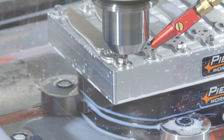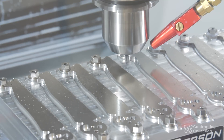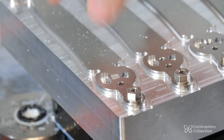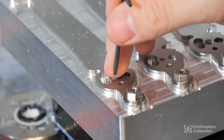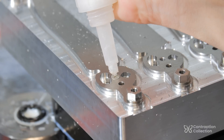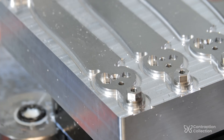Then I can cut the outside contour. The only thing I have to do specifically on this side is countersink half the blades, which can be hard to measure. I accidentally made an adjustment and forgot to take the screw out — whoops. I need a better way to measure. I tried gluing a screw to a little wrench but it didn't work so good. I should probably figure out the real way to measure countersinks — maybe put a ball bearing inside or something.